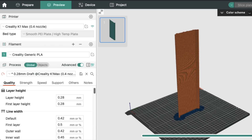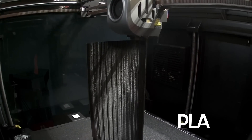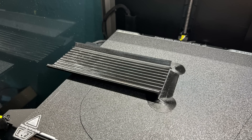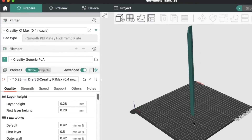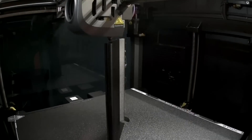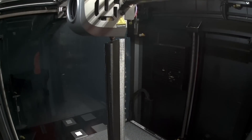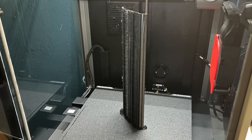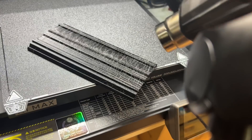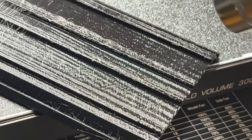I set it to 290 millimeters and printed it straight up on my K1 Max. It did a really good job with standard PLA, but about halfway up it fell over — it broke away from the brim. So I thought: what if I turned it 45 degrees so it's equally in the X and Y direction? I sliced it again, printed it, and this time it came out really good. The very top was wiggling a little bit but it stayed in place. Now it was very stringy since it was some old PLA, but that's not a problem — it just blows off with a heat gun.